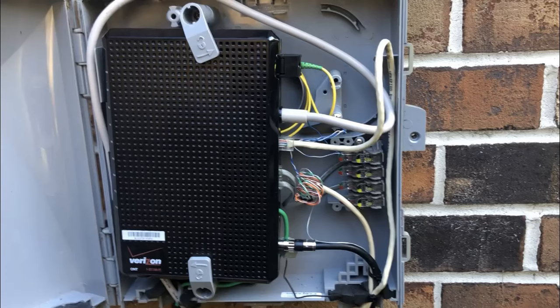Right above that are two telephone line outs that go over to the connection panel. The FiOS people who set this up took a CAT6 cable and used the blue and white strands for the first line. There is no second line in this setup, so I'm only using line one. That cable feeds my original telephone box which has two lines going into the house — one was line two but now it's its own separate line, and the rest are daisy chained. I only have four other lines, so the rest are daisy chained with one separate line.